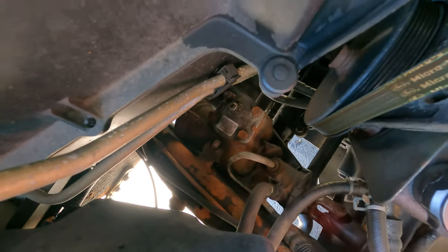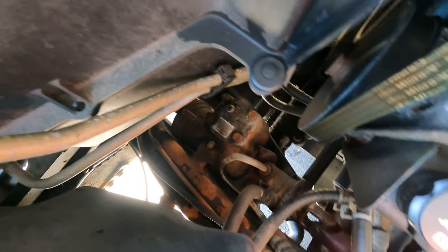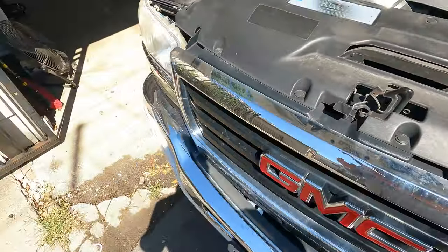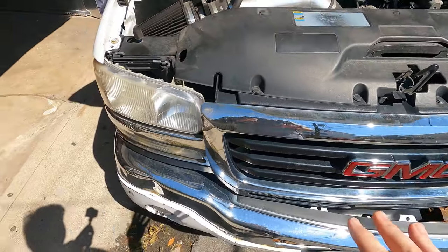if we can get down. Oh yeah, there we go. Some leaking from the cooler return lines. So I think what I'll do is I'll just get a new power steering cooler, new Hydro Boost, and just do it all at once and not have to futz around anymore with this. I feel like that's the way to go.